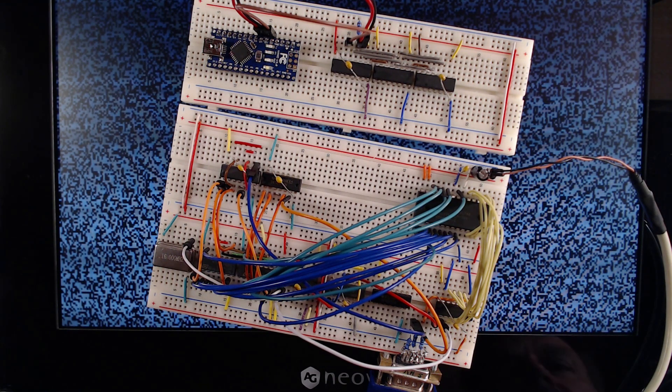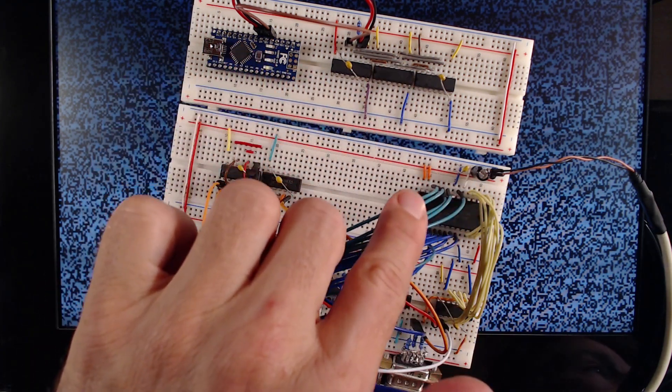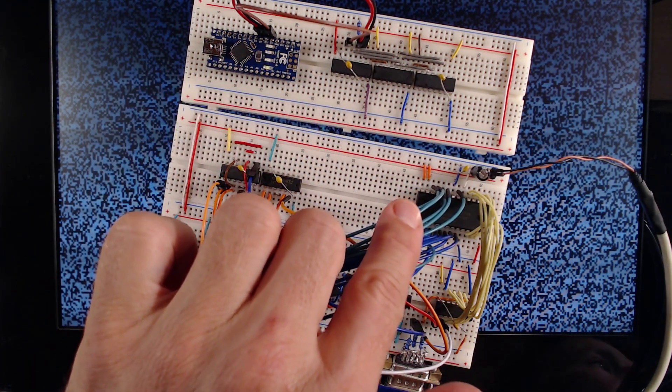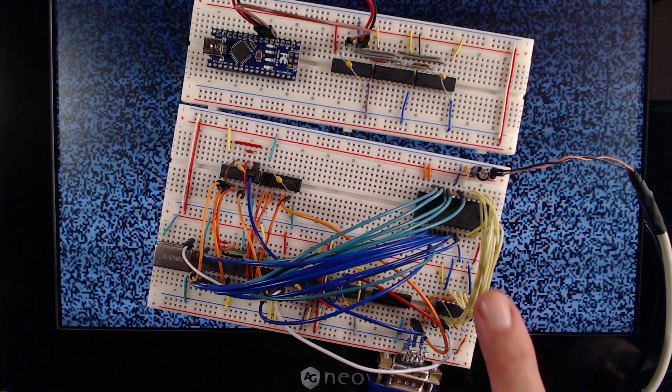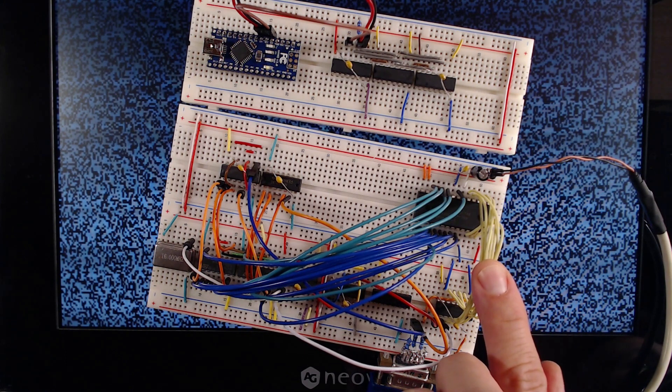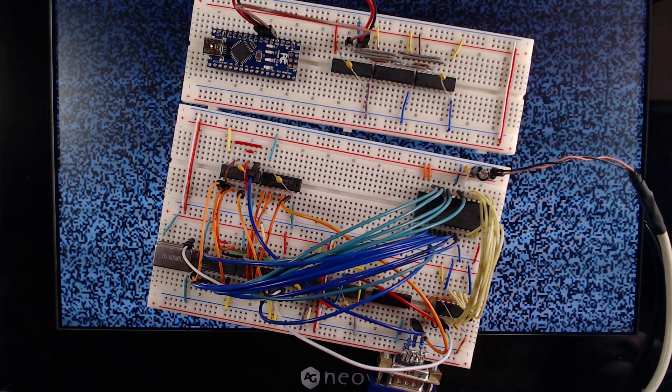But wait — we can't just simply connect this MAR to the address lines of our RAM, since we have already hooked up our VGA counter to it. And our RAM here is outputting its content all the time, so it won't be able to read anything from the bus. We need to come up with some way of timesharing our RAM chip between the display circuit and our CPU. That is exactly what's happening inside a Commodore 64, for example.